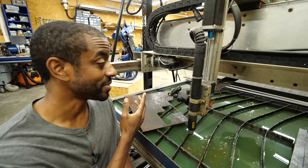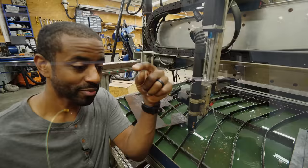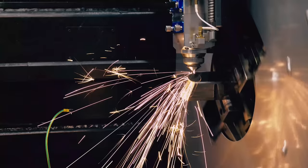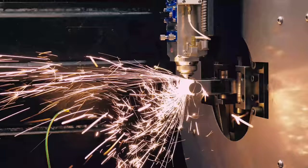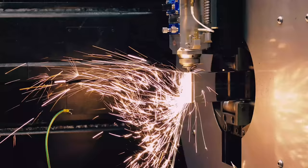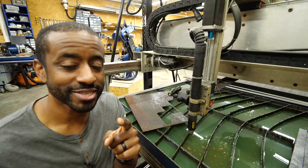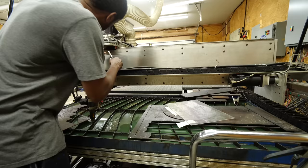Basically, I'm going to take the torch off of this machine and figure out how to attach it to my robot arm. Then I should be able to cut out things that are not flat. For example, what if I want to cut an intricate shape in a piece of square tubing or an angle iron? This has a lot of applications in the industrial environment — if you want to cope an I-beam to allow them to be welded together snugly, then a robotic plasma cutter is going to be the way to go. My goal today is to mimic that kind of application with Jarvis.